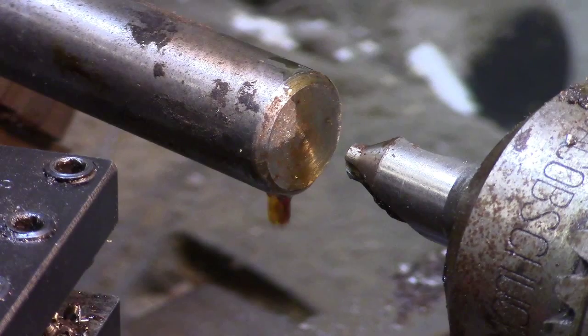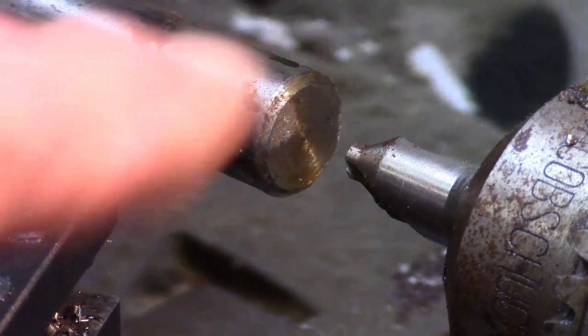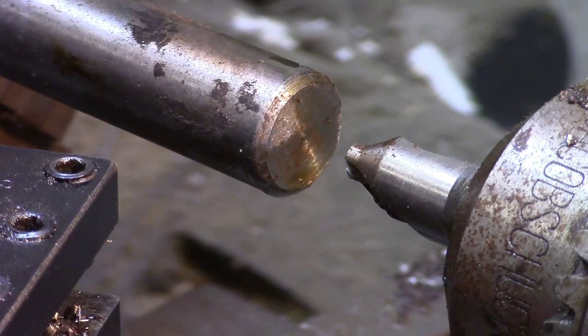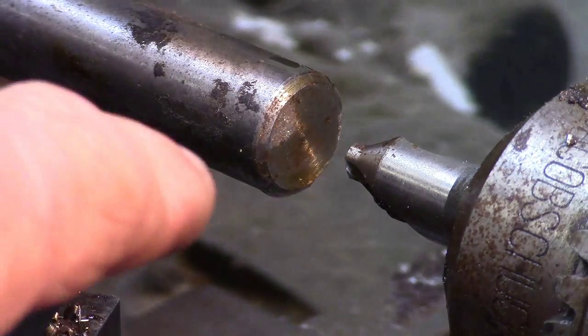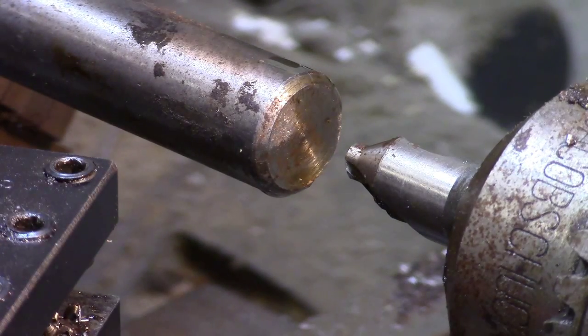What we're going to be doing — I thought this is something that some of us need to know because I was taught it, and I've taught it to somebody else that doesn't know — we're going to drill and tap this piece of three-quarter inch shaft. We're going to start off with a center drill just to get our spot, since we did clean the end of it up. Then we'll drill a smaller drill bit, and then go to the larger drill bit.